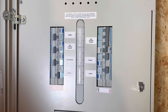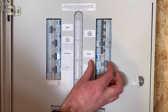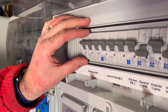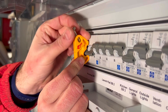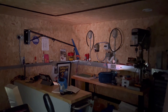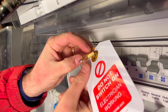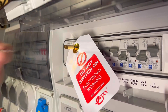Before we can undertake the test we need to do the safe isolation procedure. I don't like to turn off the distribution boards on full load current, so I'm going to knock off the over current protection devices but leave the lighting circuit on in the area. When I find the MCB that feeds this distribution board and turn it off, I'll have a visual clue that I've chosen the right MCB because the lights in that area will go off. We've done the safe isolation in two free training packages — I'll leave a link for those in the description, and they also go towards your annual CPD.